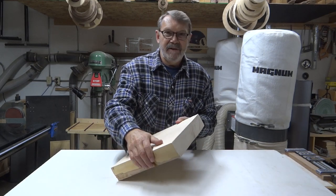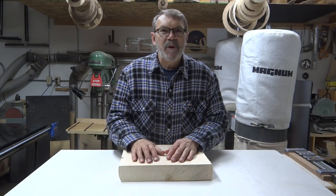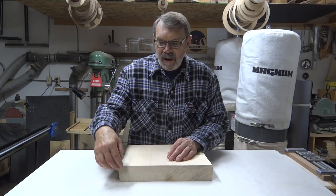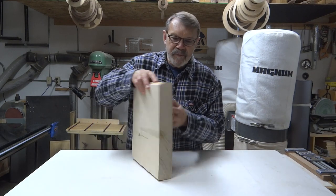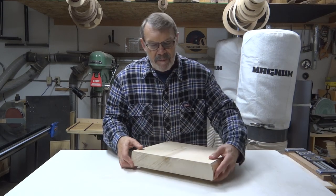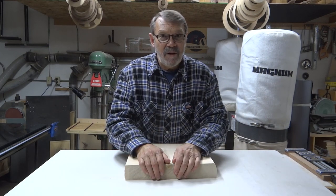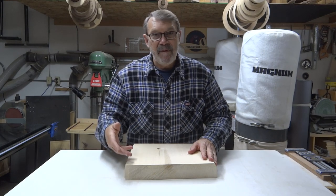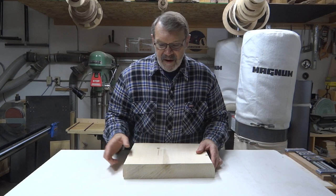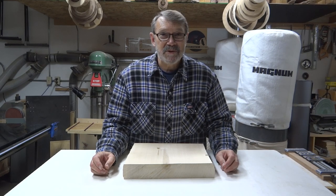With this cut off I've got a very jagged edge here. How do I go about getting straight sides and turning this into a square? I'm going to put it on my sled on my table saw, but the blade doesn't come up far enough — it's about a quarter of an inch short. So I want to make a cut as straight as I can, flip it over, and make a second cut with the blade lower down until it just barely cuts the rest. I'll eye it up, and once I have that straight cut I can put it against the fence on my sled to get a square edge on the other side doing the same flip. That gives me two sides straight but not all the way through, so I can then run those against the fence on the table saw and make four more cuts to get the whole thing squared up.